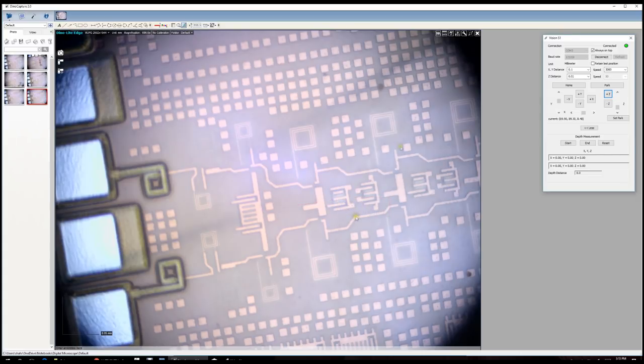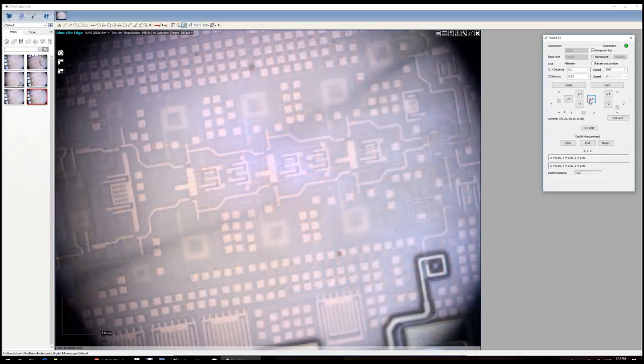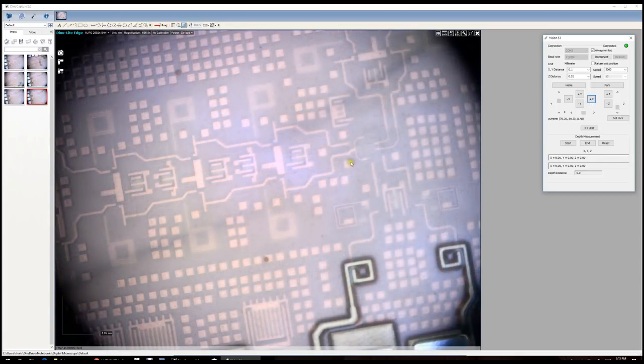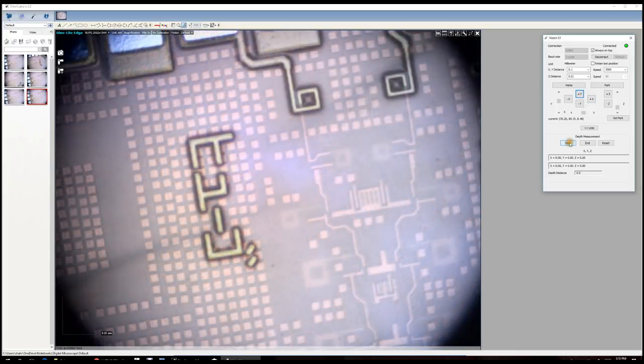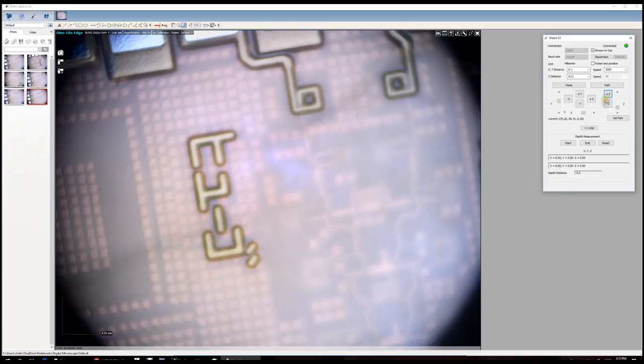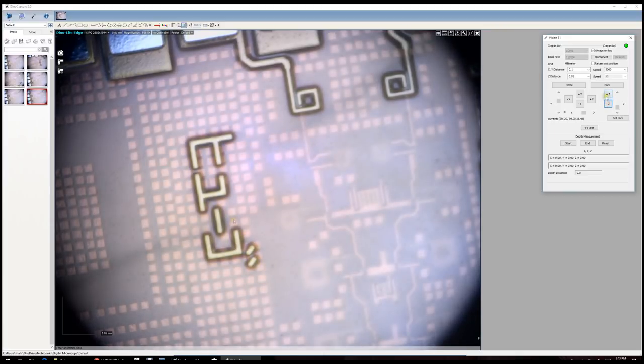Continuing along, you can see the signal flow, and at some point we're going down here — this is the output. The top coming in is the 30 GHz clock for clocking the track-and-hold amplifier. If I remember correctly, somewhere in here I actually wrote my name in Japanese — my middle name in Japanese — just for fun. And there it is. I should be able to focus on that too. This chip is actually mostly empty — it's about 160 microns plus the size of that little graphic. The clock is coming down here, and if I go further down, we'll eventually reach the output pads.